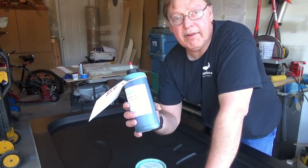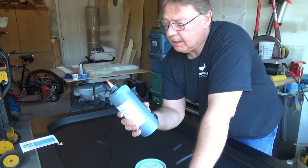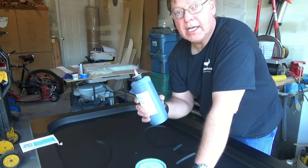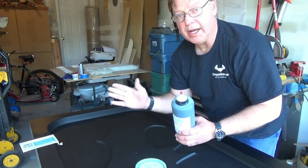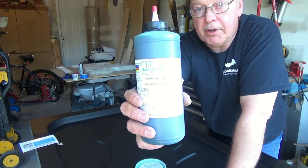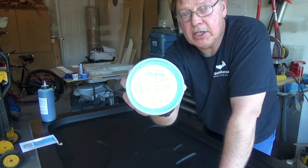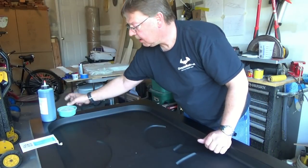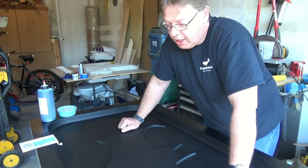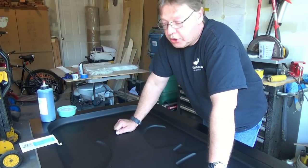The product I purchased is a polyvinyl alcohol — a water-soluble liquid that goes on in spray form in several coats. The idea is to fog it on as lightly as possible, two or three coats, then each subsequent coat you put on a little wetter until you get it to flow nice and smooth. I purchased this on eBay, along with PVA release wax — number 2 wax combined with number 10 PVA. That combination will give us a good surface to gel coat on, the wax will allow the PVA to release from the mold, and we'll successfully pull the part.